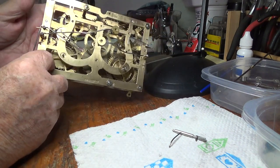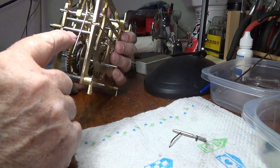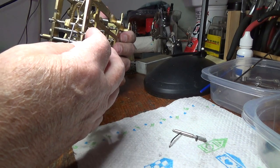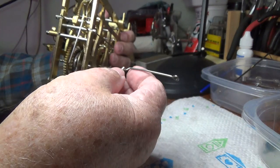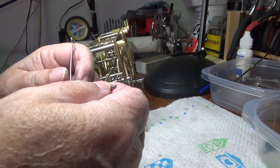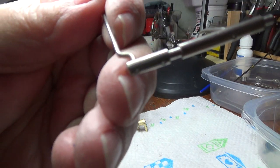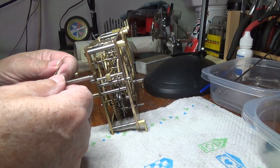then on the other side you got to have the hammer in, but then this lever has to go in next, then the brass lever. And then finally, the lift for the bellows on the quail side. And it's just peculiar how these go together. There's a little groove cut there in these things that gives you clues to which ones have to go in first.